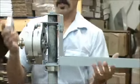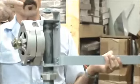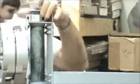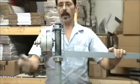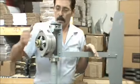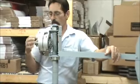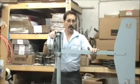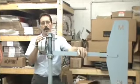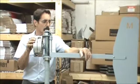Now to do an even better job, you raise your turbine up to this height, take another neoprene washer, set it down there first, slide this in, bam. Of course take the hose clamp and pinch the hose clamp. Tighten this down. Now that is a really nice setup. Lock collar down below and up above. 10 times better than bearings. These things will not wear out. You don't want them tracking really fast in a wind. The problem I find with actual bearings is the turbine will flail around back and forth because it turns too easily. And we find this system is simple, it works forever, and the turbine tracks beautifully with this.